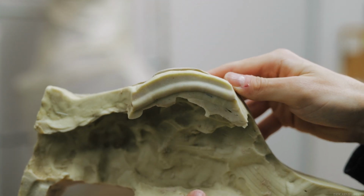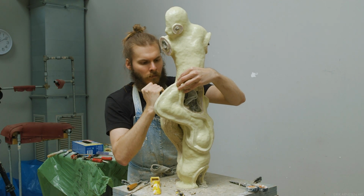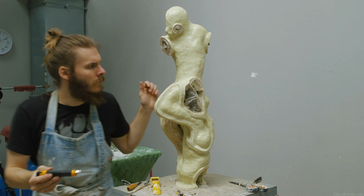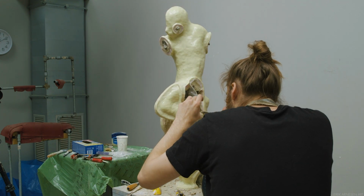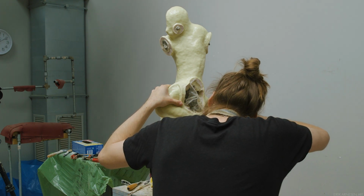The blade is quite handy, but the half circle takes up more space than a straight blade would, of course. And this means that in order to use one of these, you need to make sure that the silicone wall is a little bit thicker than you might otherwise need, so that the blade and the registration groove can fit properly within the silicone wall, without any chance of coming out on either side of your wall.